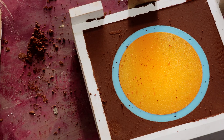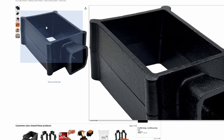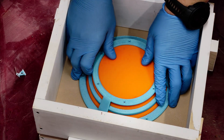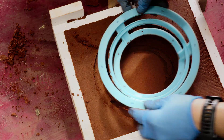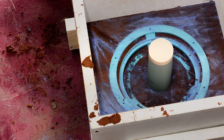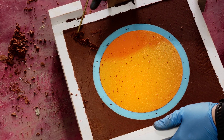Let's actually make this thing. I've pulled the prints out of the printer, and now it's time to entomb them in casting sand and pack it tight. I'm doing two-part molds with a home improvement aisle two-piece flask. I start with the bottom half, drop the speaker basket and plug in face down, and pack Petrobond around it as hard as I can. Then I pull the basket and plug back out, take the plug off, dust some release powder so it doesn't stick, put the basket back in, clamp the top half on, and pack more sand for side B. There's also an extra cylinder — that's the sprue, a channel where the molten aluminum is going to flow. I'll also cut a couple vents so air has somewhere to escape, since if air can't get out you either get voids or something very dramatic.